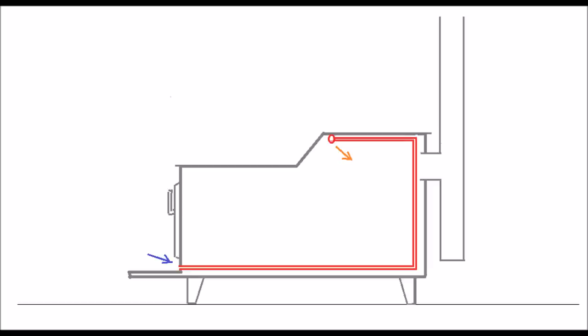The second mod was a little more involved — adding a preheated air intake tube system. This diagram: the red lines show exactly where it goes, from a hole in the front of the stove, back up along the back of the stove, back forward. It tees and vents right there.